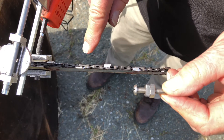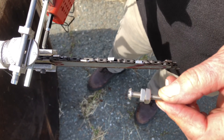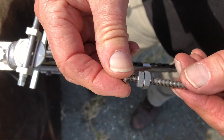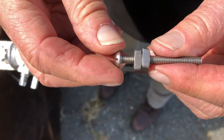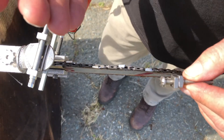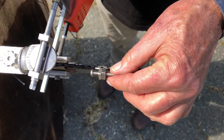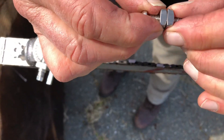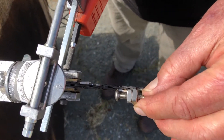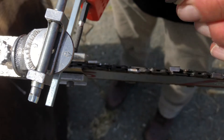It's important because otherwise the chain could cut on a curve — if one side's longer it'll take off more wood, and you don't want that, especially in ripping. I've made up this simple little screw and nut device to measure the length of the chain. If you have something more expensive like a vernier caliper you can use that, but this works as well. I set it by adjusting the nuts and locking it in place for the length of the tooth I sharpened, then check it against the one I just sharpened to see that it's the same length.